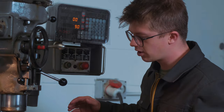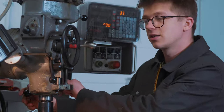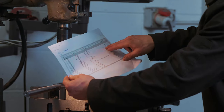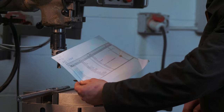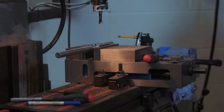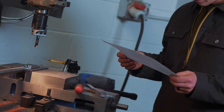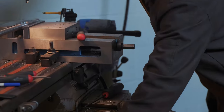Since I won't lose my position with the DRO, I move the table across, gently bring the tool down until it just contacts the steel, and pull the depth stop up to stop it there. I can now zero my Z-axis, use the table of measurements I pulled off the original, find the A inset depth. Jamie, did you mess with my bloody table? I've had this in front of me for days — here's Jamie's personal contribution, and you can see the value is 88 millimeters. Big hole A depth: 12.6 millimeters. I now bring the knee up 12.6 millimeters, and I now know when I reach the quill depth stop, I've reached the very bottom of the hole we need. Time to do a lot more fiddling with this tool and cutting tiny chips.